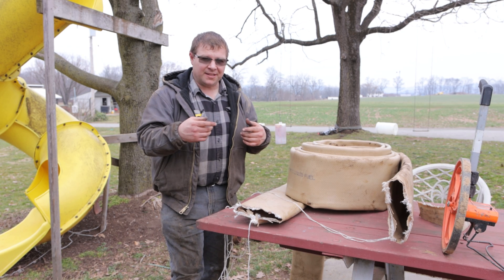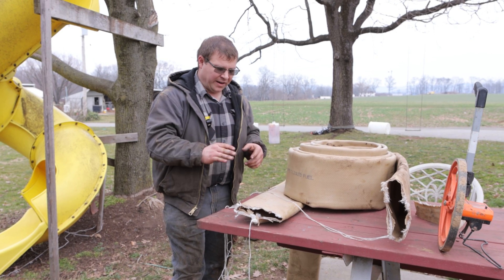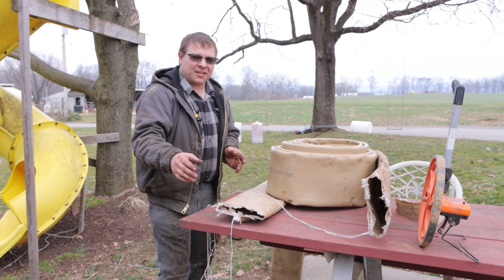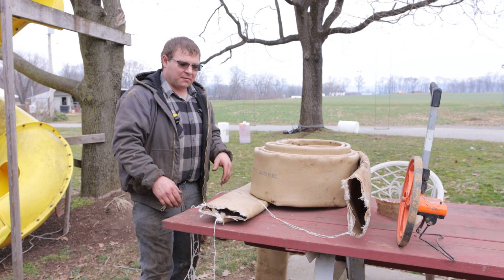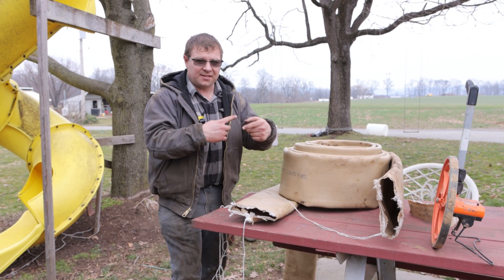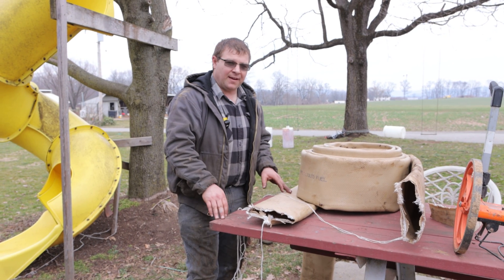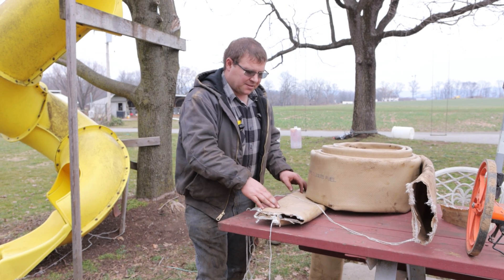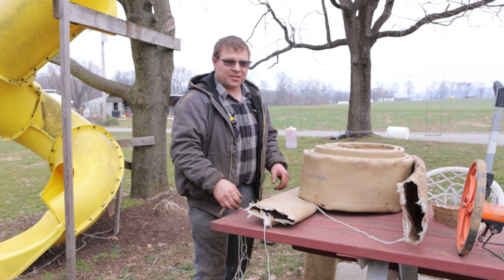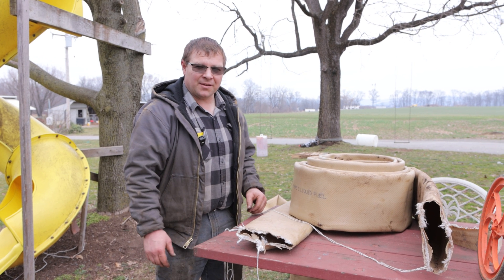Should you swap ends on your hose? Guys in the Midwest without rocks will flip their hose as they wear the cover off. Here in Pennsylvania, we just keep shortening it at the tractor end, adding new hose at the far end, because our hose gets cuts from rocks. If you switch ends with cuts and weak spots already present, it will blow out easier. We typically have more trouble with blowouts from cuts than from tearing off. A big tractor does not make stronger hose. If you need new hose, give us a call — we'll be happy to help.